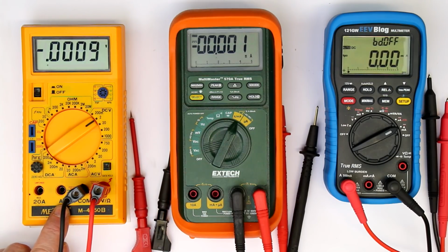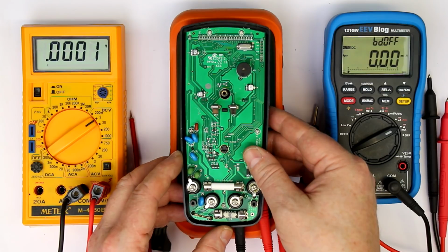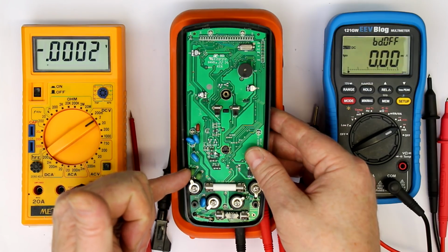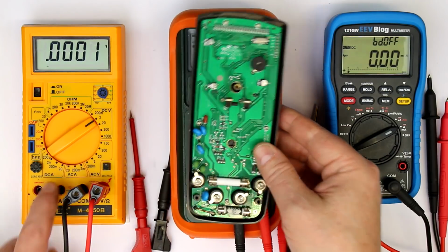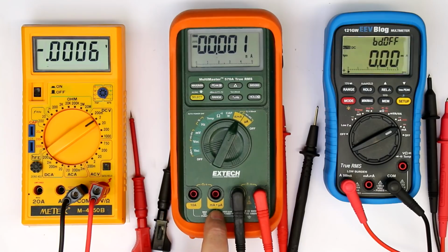That is here with a single spark gap, while in more modern multimeters you find a whole range of protective elements like these blue varistors, these little green MOVs, metal oxide varistors. Here we have another varistor. You usually also have some diodes. Well, here are also some 1N4001 antiparallel diodes in the common input. But also there I will give you a link about multimeter protection, and you can also watch the teardowns of especially the X-Tech where I explain all the components that I used there for input protection.